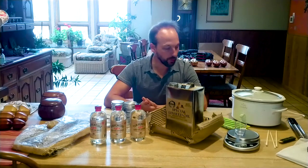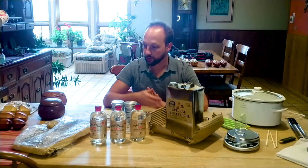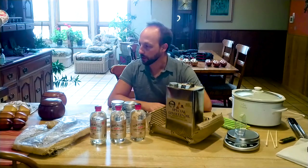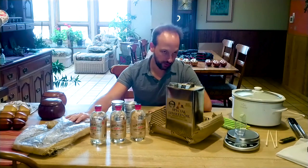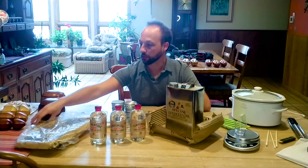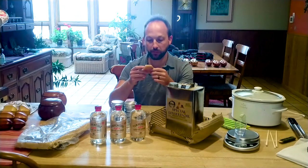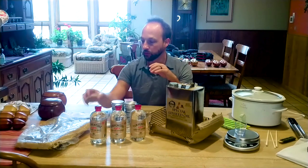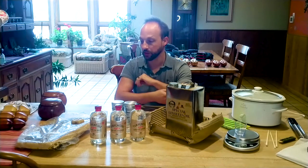So when we're getting into what I'm going to use for this product, I've got beeswax, linseed oil, and turpentine. Beeswax is great. Beeswax is a natural product, technically food safe. I wouldn't really want to eat it, but like raw linseed oil, it is something you can have on your hands, assuming you don't have any allergies to it. And so beeswax is my first choice.